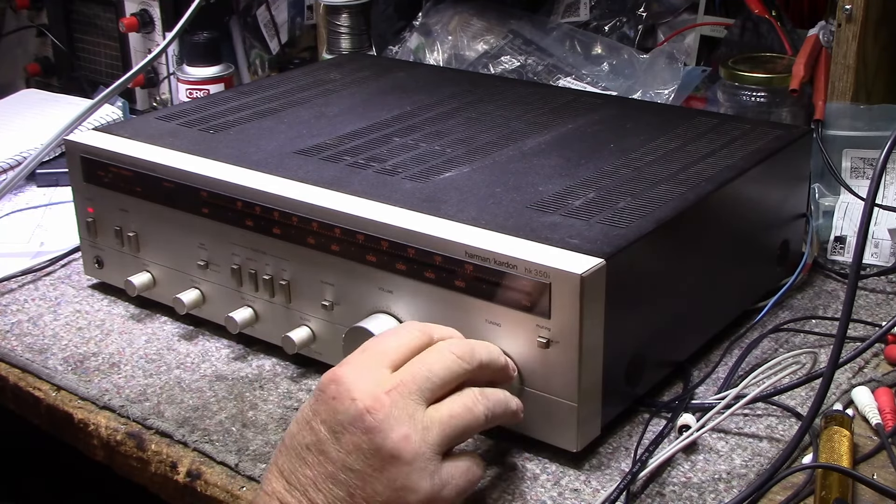I don't hear anything in the left or right channel — the left channel has hiss and bleed through. The right channel is coming through in bits and pieces, might be a dirty switch. On phono, there's silence — nothing coming through. I play with the switch and it comes back in, so that's a dropped channel if we left that alone.